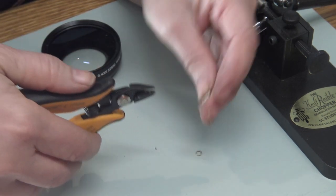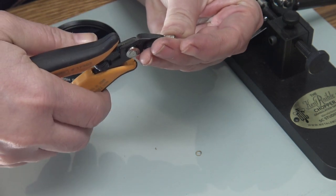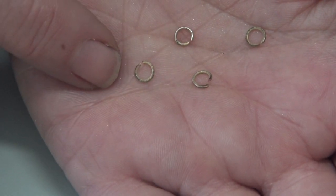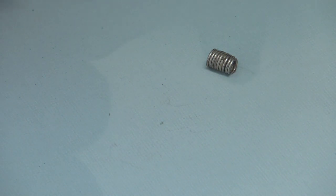Snip them consistently at the same spot each time to get little jump rings. Once your tiny jump rings are cut and you have your little circles, these would be melted — usually on a charcoal block for this type of granule. With those first two methods we melt on a charcoal block since we're not making that many. Put them on your charcoal block, melt them, and you have granules in a little vial to use. You're probably not going to make thousands that way since it would take very long.